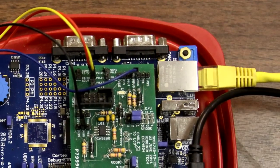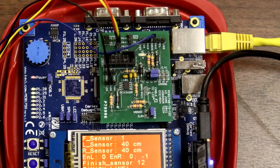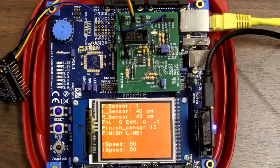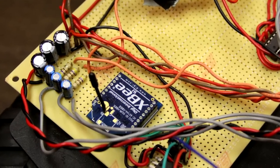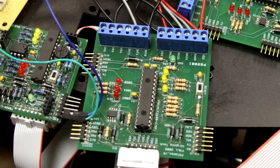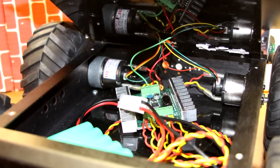The hardware requirements for the rover involve several components making up both the rover and the brain mounted off of the rover. An ARM processor mounted off of the rover provides the majority of the brain activity, communication, and decision making. Communication must be done wirelessly through an XBee device set up on the ARM side and an XBee device set up on the rover. PIC processors are mounted on the rover, and a Sabertooth motor controller is used to communicate to the motors.